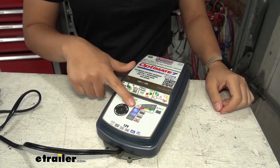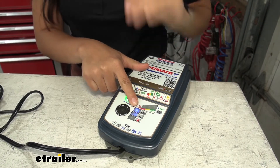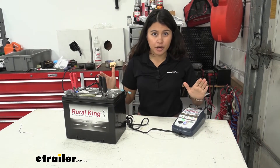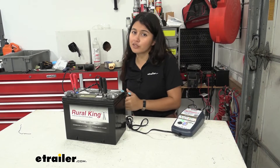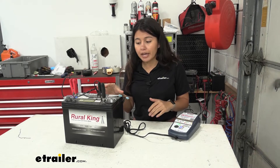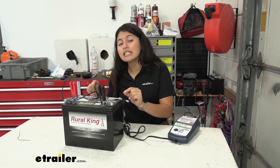We are currently in step seven: Optimize. This is where the AmpMatic charge is delivered, optimizing those individual battery cells. During this step you're going from 75% all the way to 100%, and it can take anywhere from 10 to 120 minutes. This is where the OptiMate really comes in — those individual cells are equalized during the optimization process.